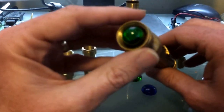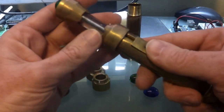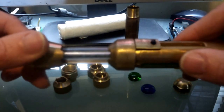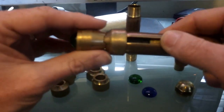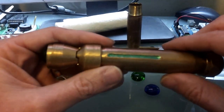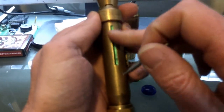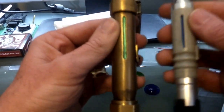The top is off the Mark I — I just salvaged the Mark I to make the Mark II, which is why it had the plastic Radio Shack top. It's just an LED cover. You can see that the plastic here is very cloudy with a lot of scratches from passing in and out of the body, and it's really hard to see the black and green wires inside because of how cloudy the inside cut is as well as the outside. I wasn't real happy with the first batch of acrylic. And this one really didn't get a whole lot of body decoration other than the stripe, which I used a ball sander piece on. Now I have this circular router bit that I put in the Dremel and just follow a straight line to cut a little impression in there that's easy to paint and you can pass your thumb over it without rubbing the paint off — to make the side stripe that appears on the prop.